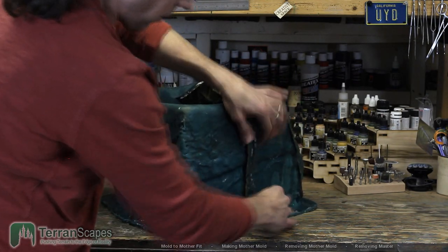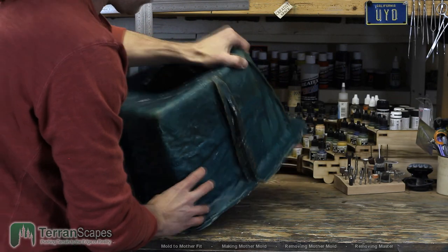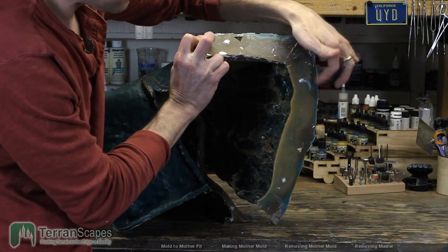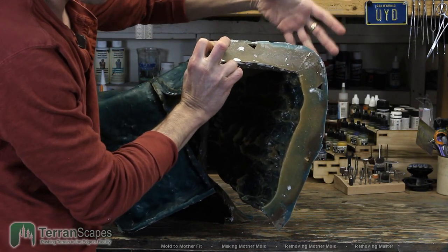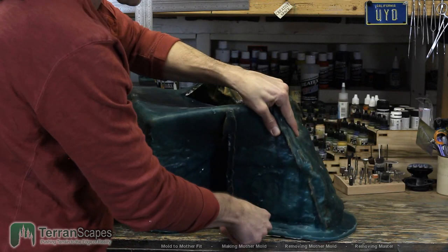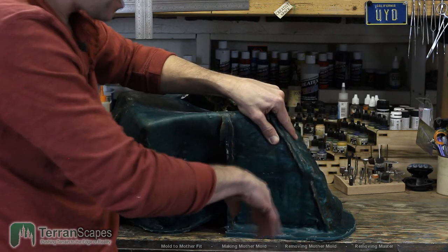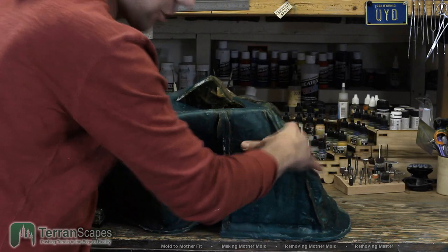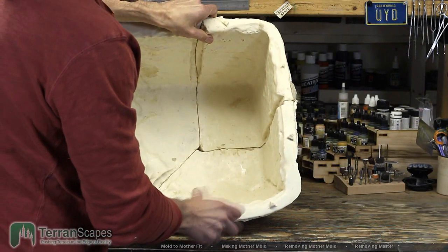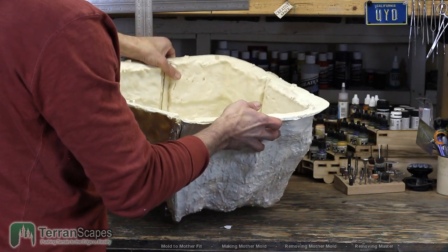And the other thing I did before I built the mother mold was to cut, actually you can probably see them like this. So I cut slots into the rubber before applying the fiberglass for the mother mold. Instead of, in the past, what I've done is I've created a little rivet bump with the rubber that would then kind of sit in. Instead now, these fit over pegs so that it clips into the mother mold, and that works much, much better.